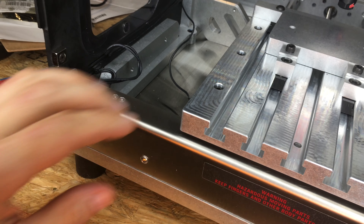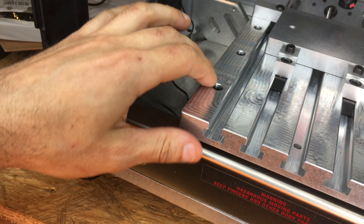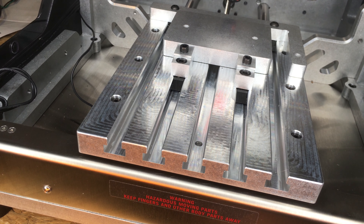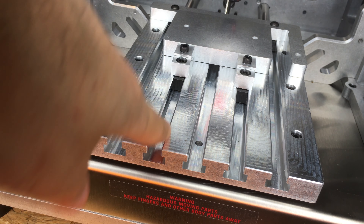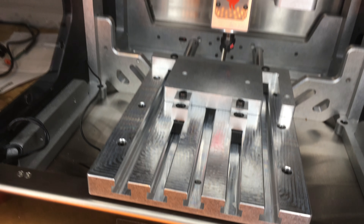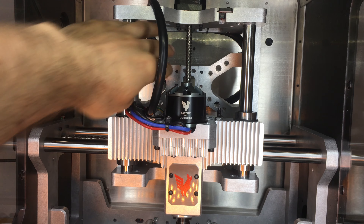It's weird that they're not face-milling this plate — you can see it's machined by a quarter-inch tool, maybe three-eighths. I'm curious; maybe they're machining it on their own machine. If I were using a Haas I'd just use a four-inch face mill. The T-slots seem like an industry standard — actually a pretty wide, hefty T-slot, which is neat. They've got their squaring fixture bracket there.